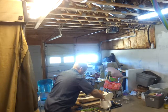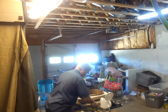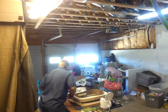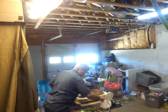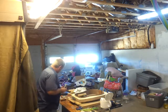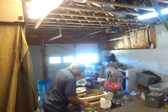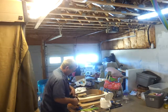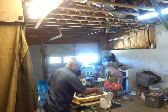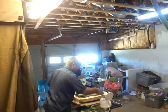Okay, the glue out, hide glue. And the lid off of it. Stir it up a little bit. Seems that's looking real good actually. We get our clamp ready over here. Got it ready. And let's check the temp on that hide glue. Hide glue needs to be around 140 to 155 degrees working. It's a little bit low. It's boiling now, so I'm going to bring it up.